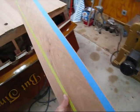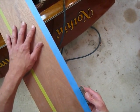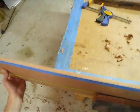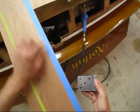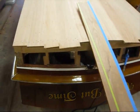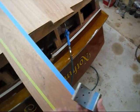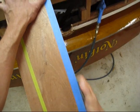After coming up with that plane idea, I thought, I remember I had this block, and why couldn't I just stick some 40 grit on there? You can see I'm just proud of the line here. The big advantage with this is I could have the plank right in front of me and see it, as opposed to it being in the vise where I'm always having to lean down and bend over. Once I get close to the line with either the plane or the spindle sander, this thing is great because I could just ride this surface on the back and I know it's going to be 90, because these planks fit the other planks always at 90. I could hold it in my hand real nice and work right down to that line.